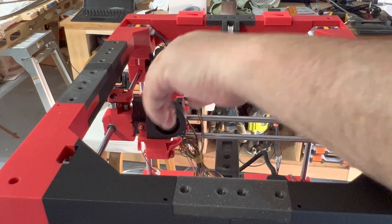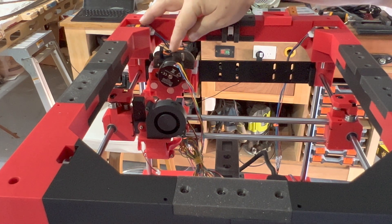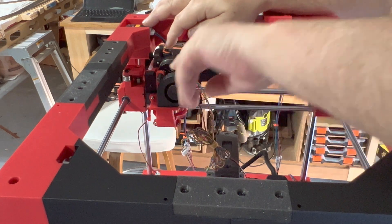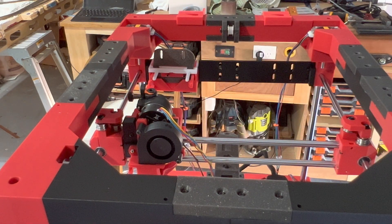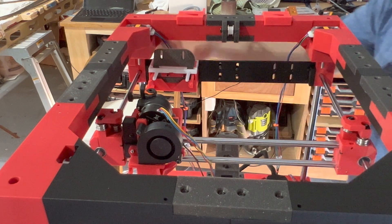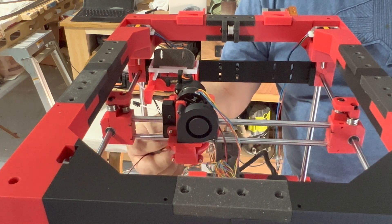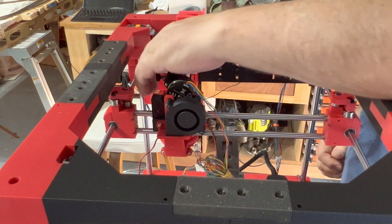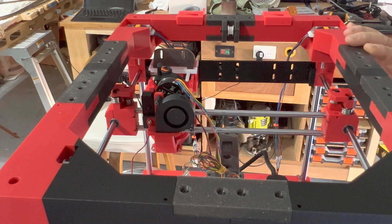The removal is basically just a reverse. There's a moving part at the back which gets pulled down — I'm doing it currently by hand just pushing it down — which is opening up the two grabbers, effectively releasing it. So it would grab like that, the grabbers would open, and then it can just move back and it's got it engaged. At this point it's still got a 1 to 2mm gap between the magnets, because there's a small hinge on this side which needs pulling back. You can see how they do that — it just moves it down a little bit, bringing the magnets into close proximity. I still need to add the mechanism to pull that so as it retracts, that bar gets pulled up and it locks back in place with the magnets.